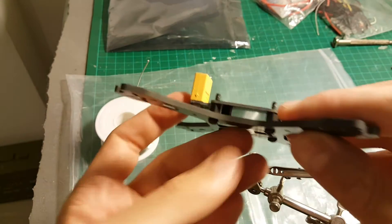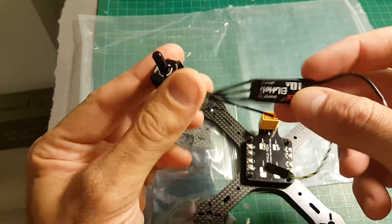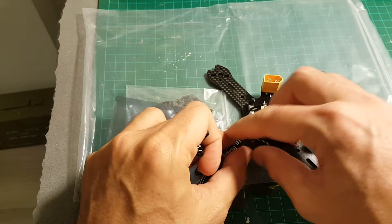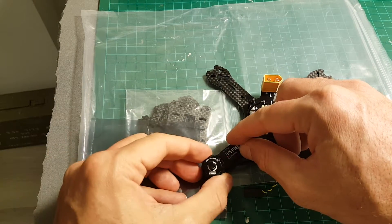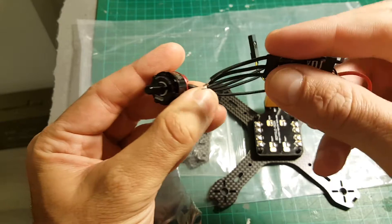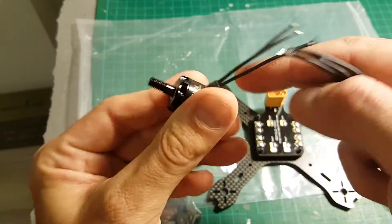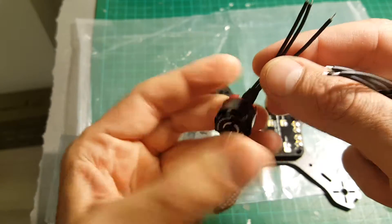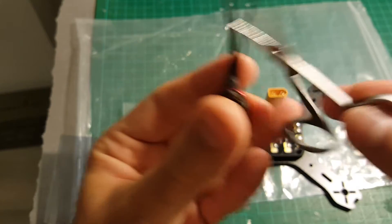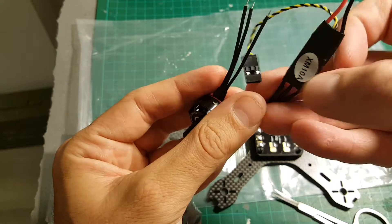We are done and we are going to continue to place the ESCs. We are going to connect each ESC to the motors. As you can see this build is a bit tight, so for example the ESC is going to be placed here and the motor here. We would like to cut these wires and connect them to the ESC — be careful not to cut the wires too close because you are going to have some problems soldering it. I recommend cutting around here and then soldering it to the ESC.